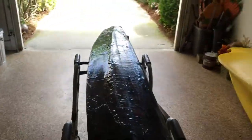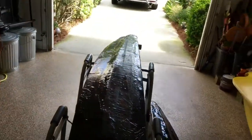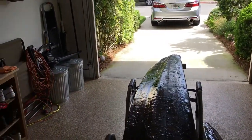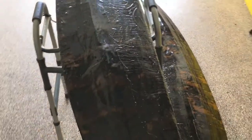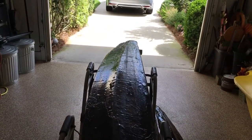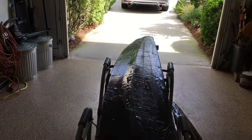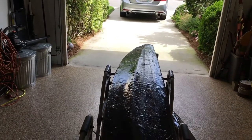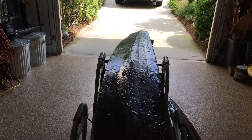Number one — you'd probably recognize this. This is the outrigger off of my kayak. This started life as a standup paddle board, a rigid plastic standup paddle board, roto-molded much like that one right there. I took it and ran it right down my table saw. Use common sense — you have to really jack your table saw blade up. It's not a very square item to be running through your table saw, so you probably ought to have help. You've been warned.